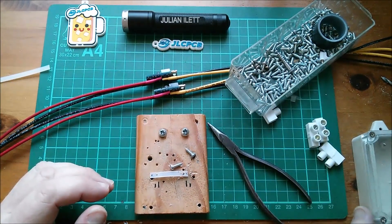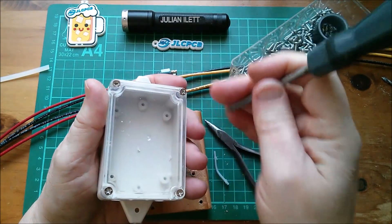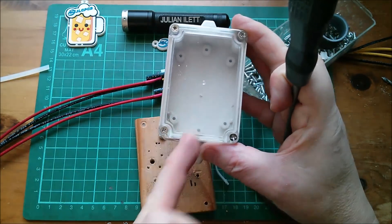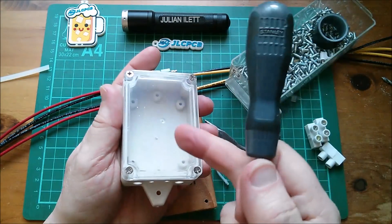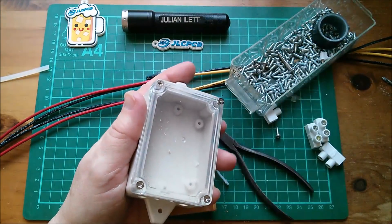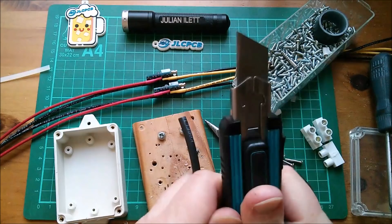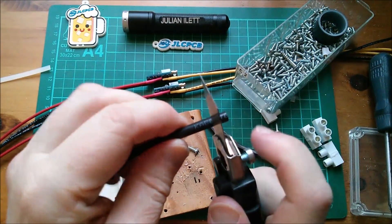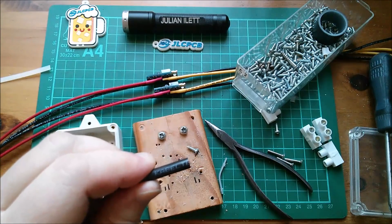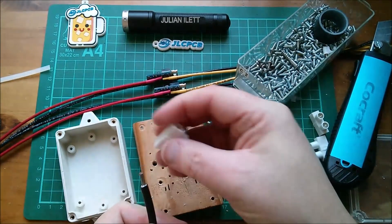These screws are my sort of universal small-size screws — they should go into these pillars. Now, a mistake I made last time: this sits over the battery and the wires coming down from the solar panel are on the left, so I want the solar cable curling out to the left. I didn't do that last time — I think one went one way and one went the other, which wasn't really correct. So let's do this where it all goes to the left. First thing I've got to do is strip this — it'll have to be done with a knife because it's pretty massive cable. I only need to strip about a quarter to three-eighths of an inch.